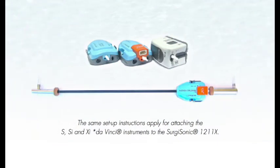Because a tight seal separates the jaw pulley end from the shaft control box end, we have developed a patented dual hookup method for independently cleaning both the distal and the proximal segmented areas of a DaVinci robotic instrument at the same time.